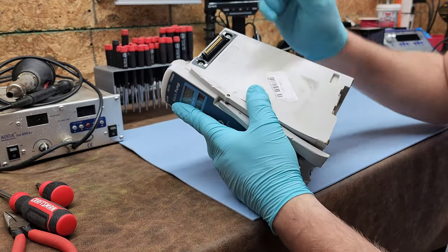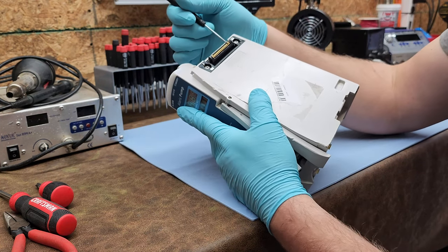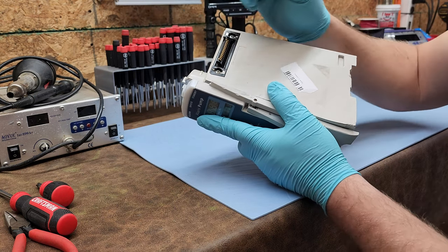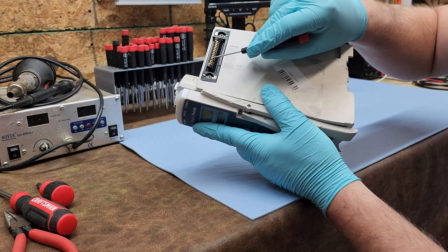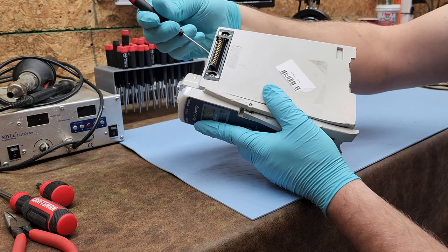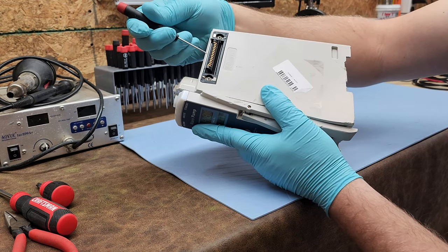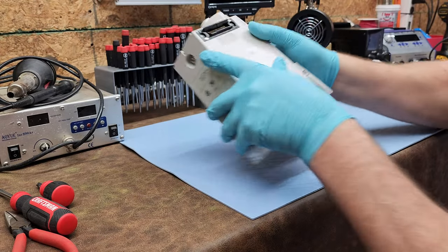There are one or two ports on this which will get corroded very heavily. There is also a plastic separator in between the male contacts, and you have to make sure it's not smashed. If there's any smashed divider whatsoever, the female pins that are supposed to overlay and interface with this will not mate correctly, and you will get channel errors.